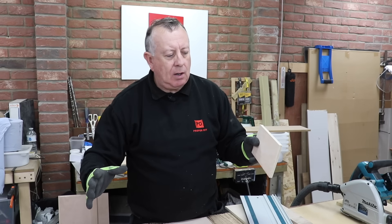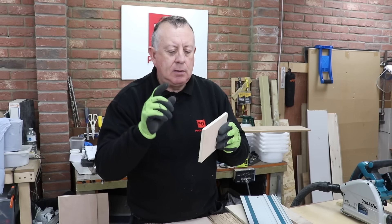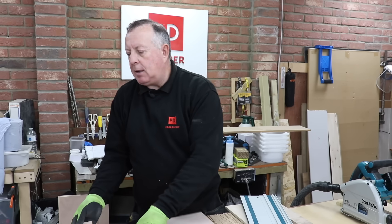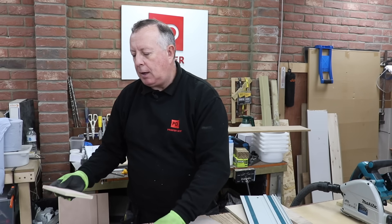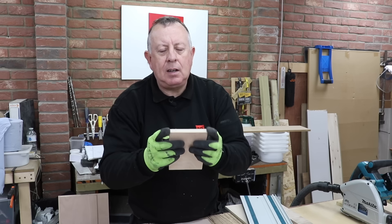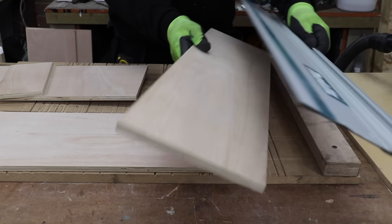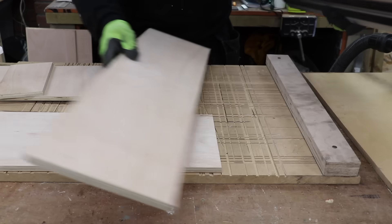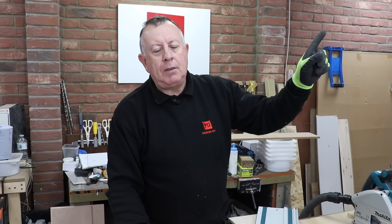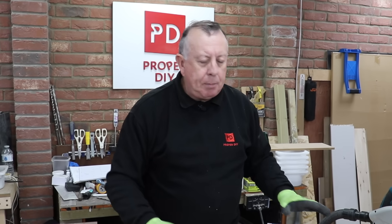I'm going to have six on either side and 12 in total. The gap I've designed to be exactly 18mm between this one and the next one - not 20 because I can't replicate 20, so I went for 18 and cut an off-cut of 18mm ply which means I can replicate it as I go up. Width-wise I've already cut a strip that I can cut all of these out of, so they're all going to be the same width. But in the other direction I want them millimetre perfect without spending too much time making another 11. So I'm using a setup with a rail that's exactly the same width as the rail, where I can replicate these cuts time and time again, getting them exactly perfect without any measuring.